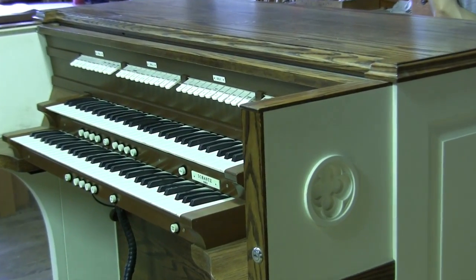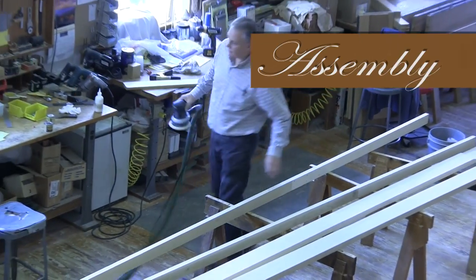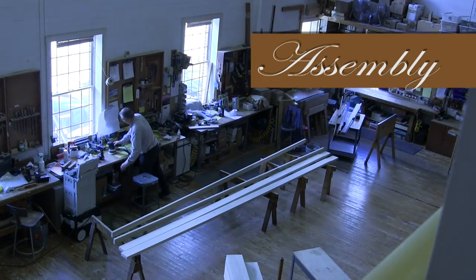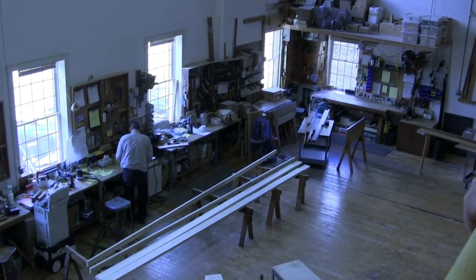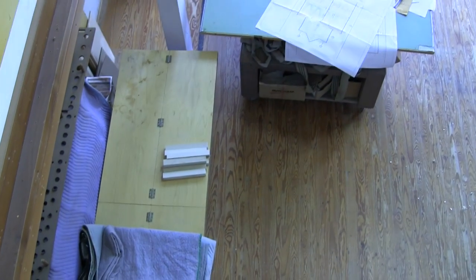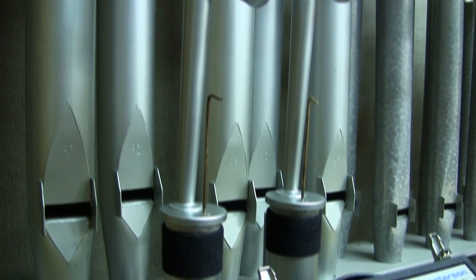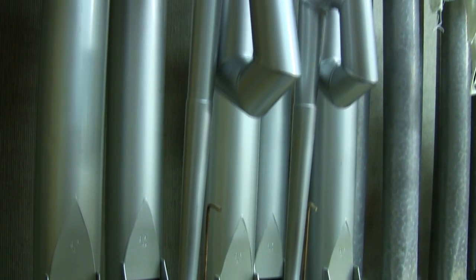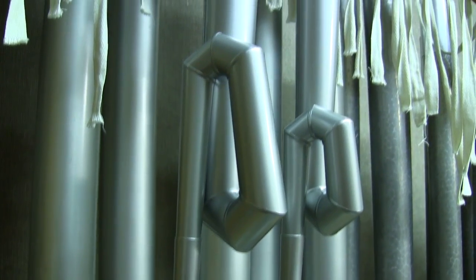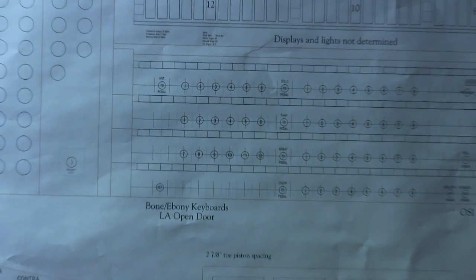There are all kinds of wind chests, and we'll see that down in the voicing department where there's actually a small pipe organ. That organ will be assembled in the assembly room here. With big organs, sometimes at night we'll leave the lights on because people like to drive by and see them. We don't play complete organs here — you might think that's odd — but we voice each individual set of pipes, test each wind chest, and test the console and all its components. Putting it all together here is an unnecessary step; we're absolutely confident these will play.